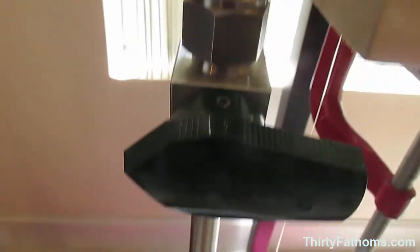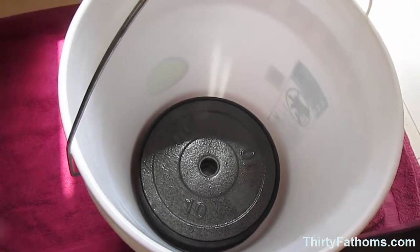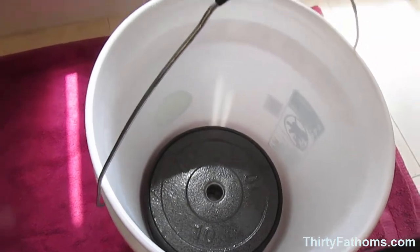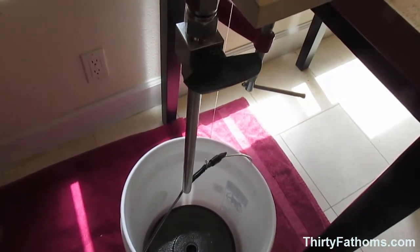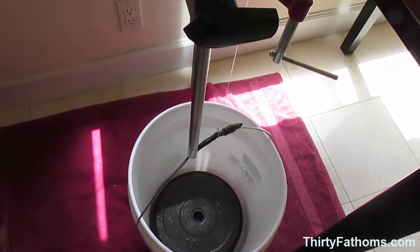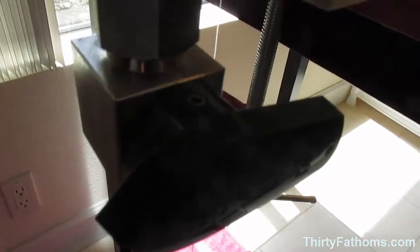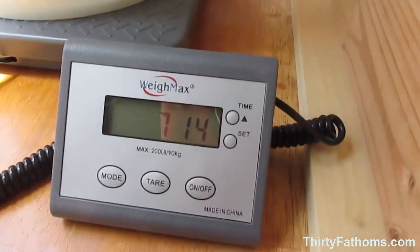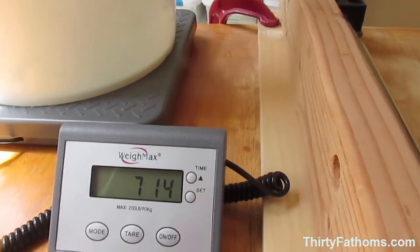As the water comes down through the piping, it comes through this shutoff valve, down through the pipe, and into the bucket. I put 20 pounds of weight in the bucket because I like to prime it with about 50% to two-thirds the rated strength of the line I'm testing. Since I was testing 30 pound line, I'd fill the bucket with 15 to about 20 pounds of weight. It makes the testing go smoother and faster and gets the line under initial tension without affecting the results. As enough water enters the bucket, it gets heavy enough that the line breaks. When that happens, the shutoff valve is closed immediately, and I go to the scale weight indicator to record the change in bucket weight and add that to the original weight — those two values tell me the breaking strength of the line.